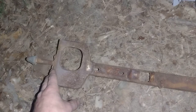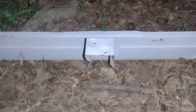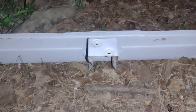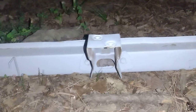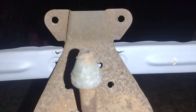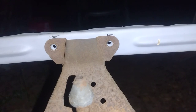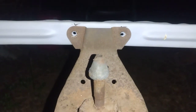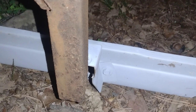Technically, even though this is a one-piece, that is the only part that's different. We can make this work and we're going to make it work. All we have to do is shorten this up — bring this down a little bit — and then our hood latch will bolt up correctly. So I'll set that on top just like that and come straight up. You can see how much higher it sits, but it lines up — that's the main thing. Our height and everything is going to be correct, and that's important. You want the hood to open and shut the correct way. To correct this, we just need to make a bracket — that's it.